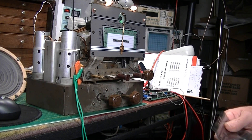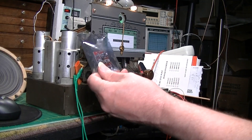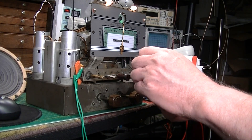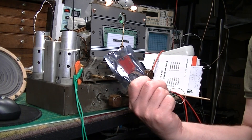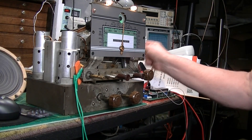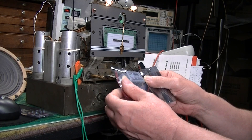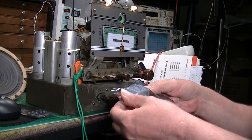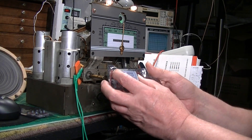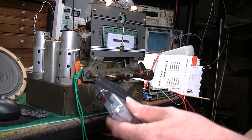So what I've got here is a little preamp that I'm going to be putting in there. The preamp needs five volts, so I've got a little transformer. I bought several of these. What I'm going to do is mount them inside the wooden case - this transformer is very small - and that will give me my five volts from the 120.